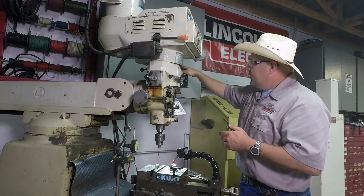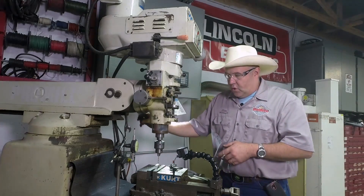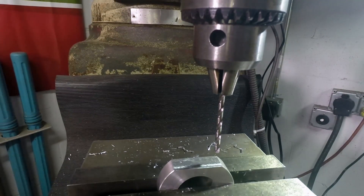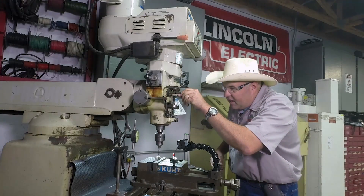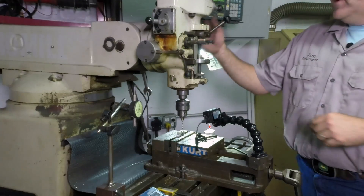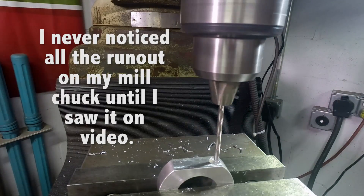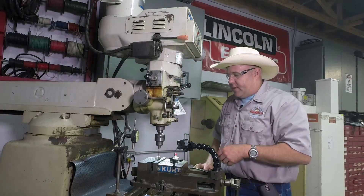I know that I need the first hole to be one tenth of an inch, or a hundred thousandths, from the spot we just marked. So crank out a hundred thousandths — we're at a hundred thousandths. I'm going to reset it to zero; that's my zero point where I'm going to drill my first hole. We need to start from zero to measure out our next hole. Let's drill a couple of holes here — put our stop right here and go ahead and use the power function on the mill. Just put a little bit of Aluma-Tap on it; our feed rate for power down feed is one and a half thousandths per revolution.